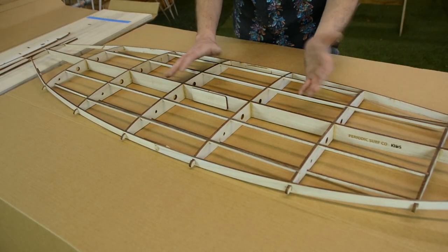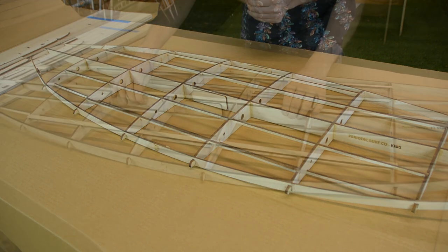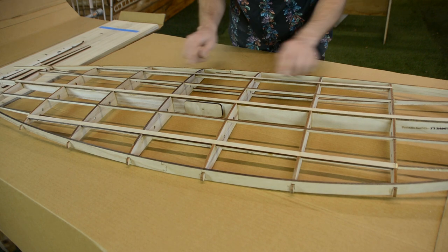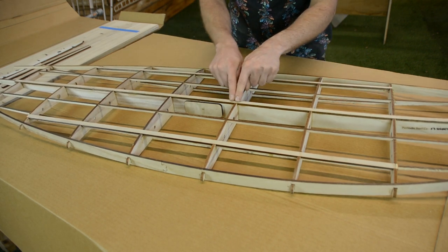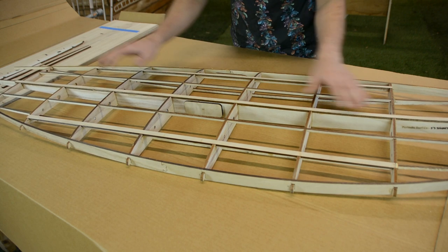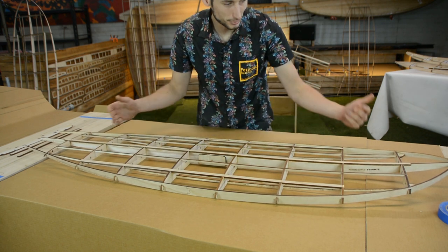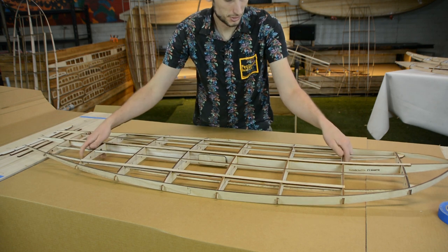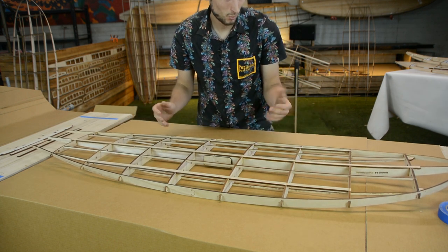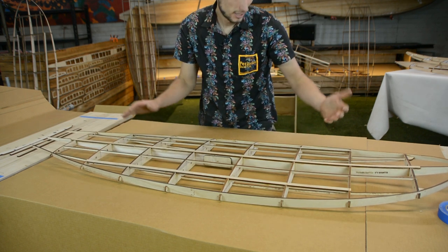This being the 5'2, it has the least amount of bracing required because it is such a small board, but on our bigger boards we have some interesting concepts. This frame here is our 5'5 shorty, and you can see it's a little bit different. On the central spine we've increased strength quite a bit by adding this stiffener, which helps increase the stiffness of the board and keeps everything nice and square during glue-ups. All this structural material and added bracing gives us a much stiffer frame that is more resistant to twist and side loading, making it much easier to get our skins and decks to conform evenly.